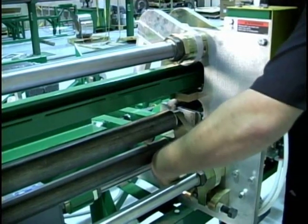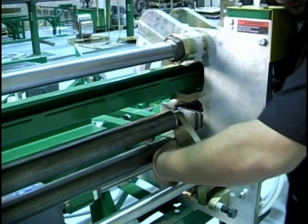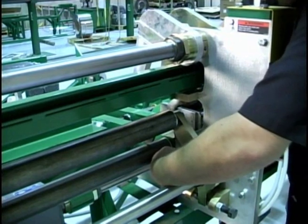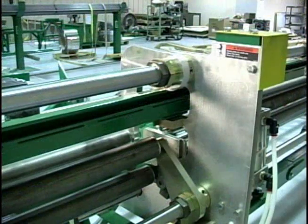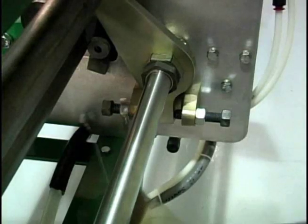The output or quick change finned tube rack can also be reset in approximately 15 minutes for the specific finned OD. Proper adjustment of the bare tube and finned tube rack assures you of better control of the tube and improved quality of the final finned tube at maximized production speed.